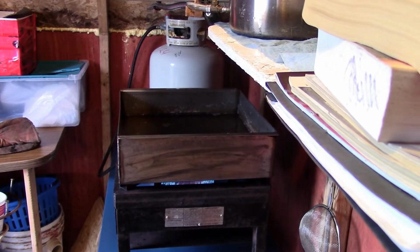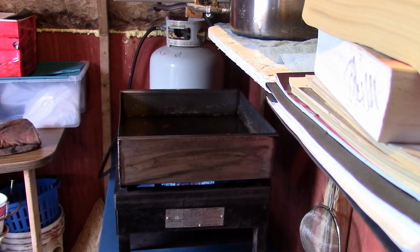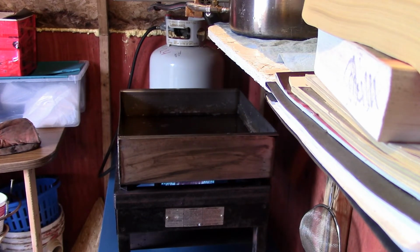And just to tell you what I did, that's a cast iron ring burner, 65,000 BTU. All the little holes in the top of it, all it is, it's a hollow ring with a million holes in the top of it, and the propane comes through those and burns. Well, a lot of those holes were crudded over with rust, and so I took a little 3/16 drill bit, cleaned out each of the holes, and then I blew it all out with my air compressor, blow all the sediment out of it. It was pretty dirty. I was surprised how dirty it was.